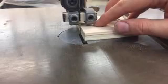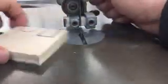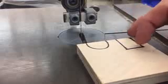And now, that's a teeny tiny gap. It's like a 1/16 of an inch. The wood moves freely. My fingers can't get into... Oh, didn't tighten it quite enough. There we go. Fingers can't get in there. Nice smooth movement. I'm ready to cut. So that is how I quickly set the guide height.